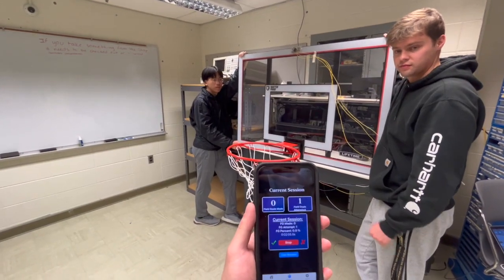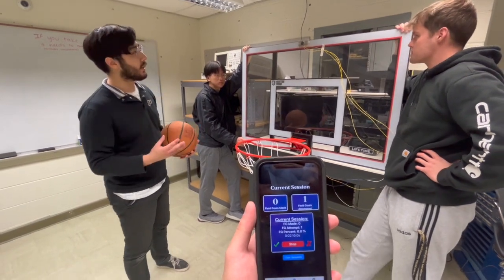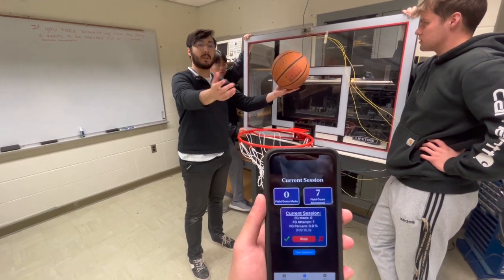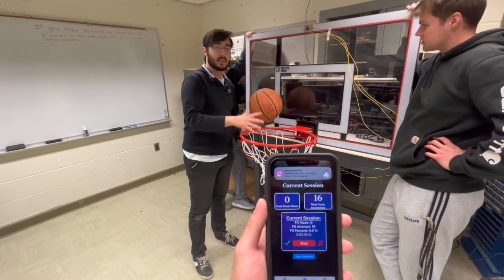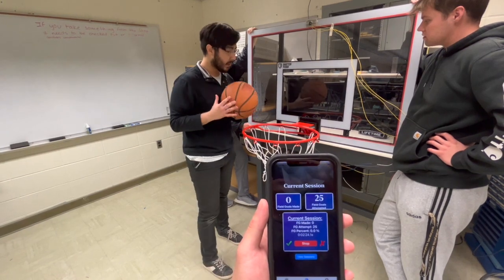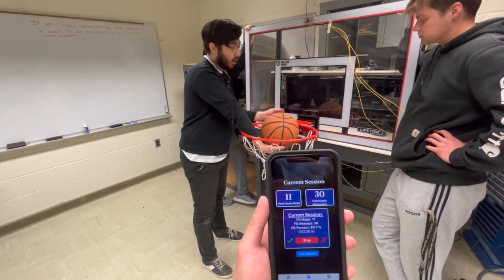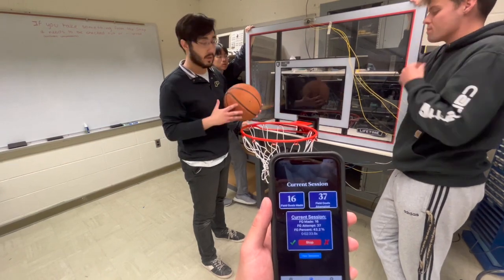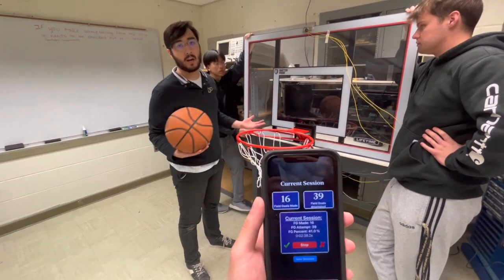This is the final ISO hoop. We have two ultrasonic sensors. The theory is that the top hoop sensor will detect if there is an attempt — as you can see the attempt meter is going up. If the top sensor sees the ball entering the area, it registers an attempt on the MCU, which transmits that to the app. When the bottom sensor also sees the ball, along with the top sensor, it knows the ball crossed through the plane of the hoop, counting it as a basket.